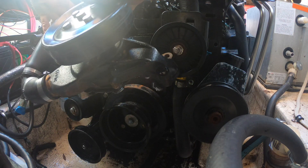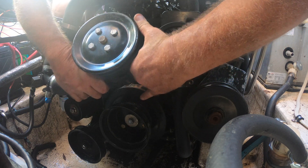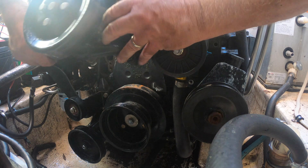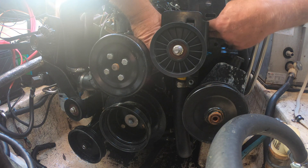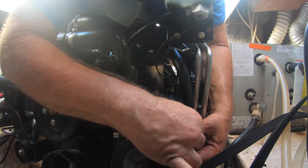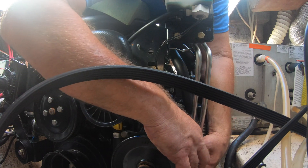Once that's tightened up, it's time to reinstall the seawater block recirculation pump that I thought was the water pump. It takes a little bit of finesse to get it into place. Initially I had connected the top hose, but it's easier if you connect that last. It has a flexible pivoting fitting, so once you get it into place you can rotate it around and connect it to the water neck — a lot easier that way. Then there's one more bracket that connects the power steering pump, and then it's time to put the serpentine belt back on.